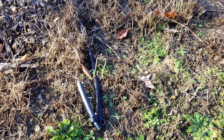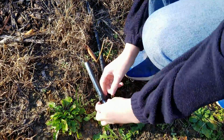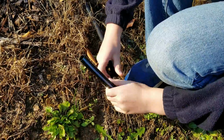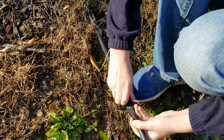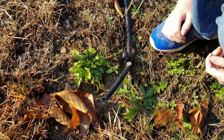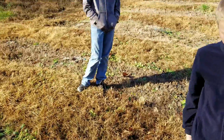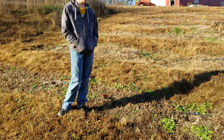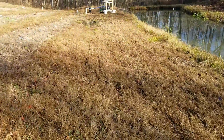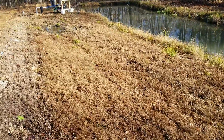All right, Riley, if you don't mind, take that off there real quick while I show these guys how we do it. Just like so. See, we already got water coming out of it. That's how we'll drain them. So they'll go through up here, take all of them off the ends of the rows. That way all that drains out. I'm gonna go drain the water out of this pump real quick, and we'll pull the filter off.